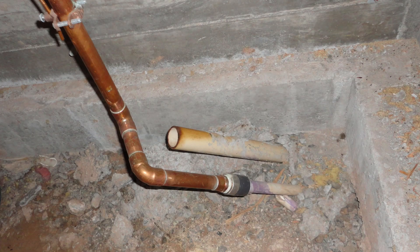Let me talk a little bit about that. There are very few homes anymore that have copper water pipes running out of the house all the way to the city supply. Most of that these days is plastic — homes constructed within the last 30 or 40 years. Copper in the ground does corrode with time. Back when I was a kid they would talk about grounding your equipment to the cold water pipe. Well, that doesn't work anymore because it becomes plastic. My house has copper internal plumbing and then plastic to the street, and nowadays they don't use copper at all — it's all plastic piping.